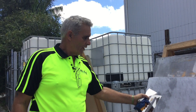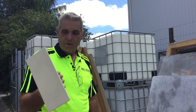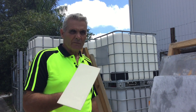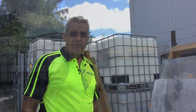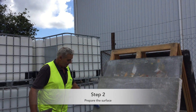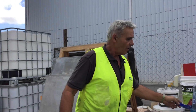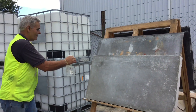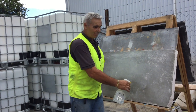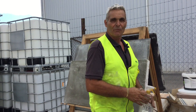If it needed patching up prior to applying the Smooth Set, depending on the size of the hole — if it was deep, I would go back to the Q Render. If it was just a couple of little scratches, I would use the Smooth Set and let it dry before putting the base coat on. Once the base coats are dry, Step 2 is to prepare the surface of the base coats for the application of Smooth Set. Because the product is so fine, you don't want any little lumps of sand and cement coming through the surface. Give it a light mist of water — it slows down the suction a little bit, slows down the drying, and gives you a bit more time to work it.